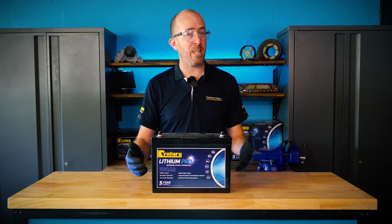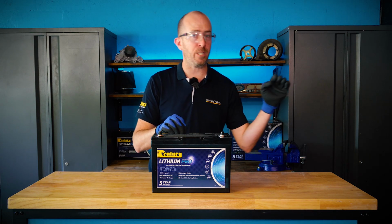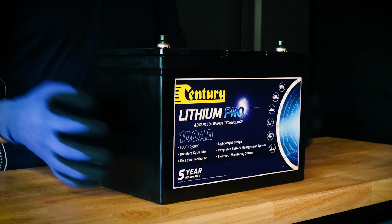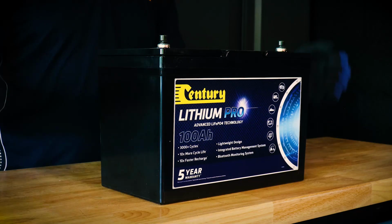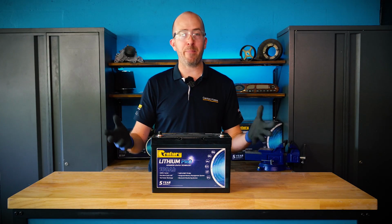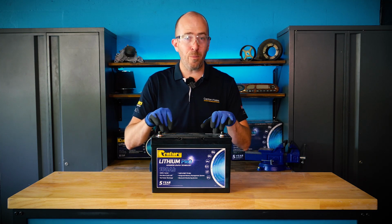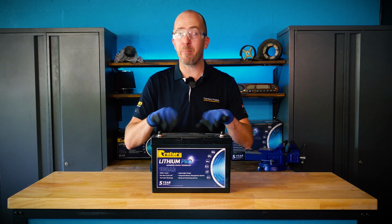If you exceed either of these limits, it'll trigger an alarm within the battery's BMS for either over voltage or over current protection, which will cut the charging process off as a safety feature. The charge itself should always be undertaken in an environment with an ambient temperature of 0 to 45 degrees Celsius, and for no more than 24 hours at a time maximum.